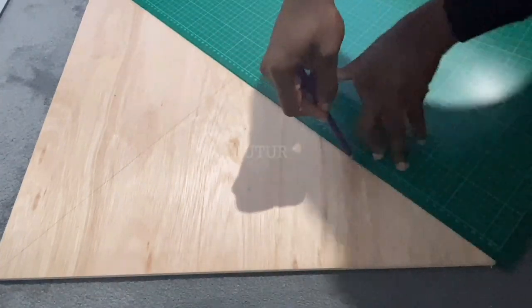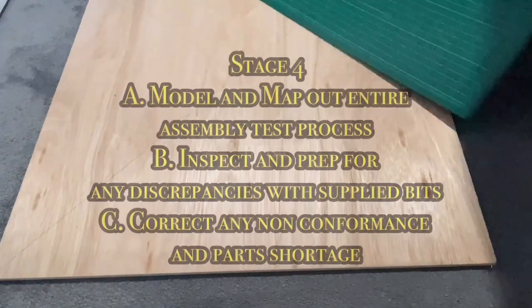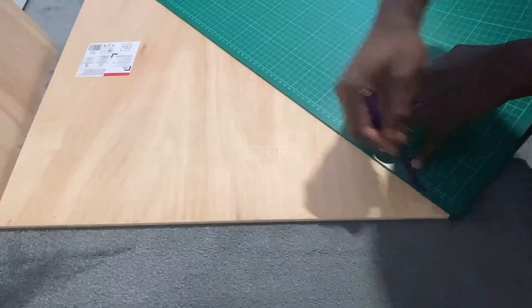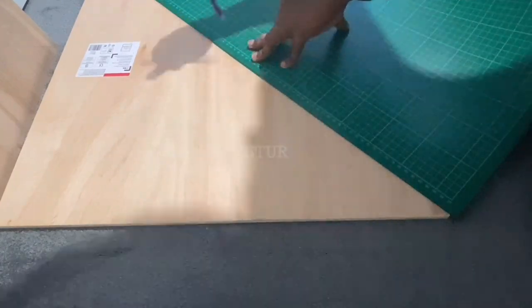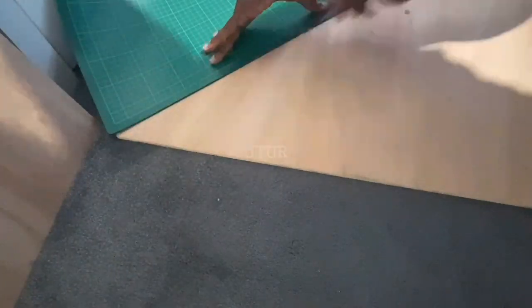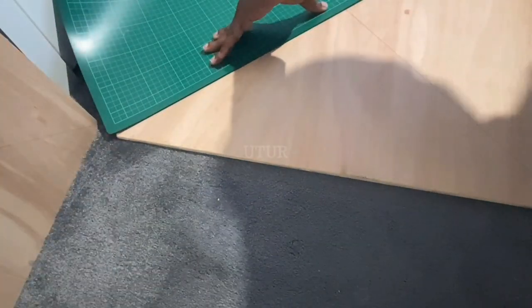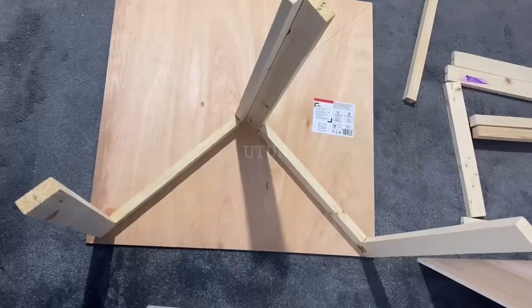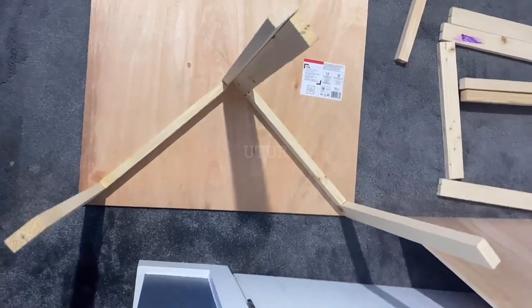The next step is to map out the entire assembly test process so that we can see at first glance if we've got any parts shortages or non-conformance at an early stage, to save on time, quality and cost — and to ensure a first-time pass yield so that the fabrication of the base trap passes first time as opposed to making reworks and alterations.